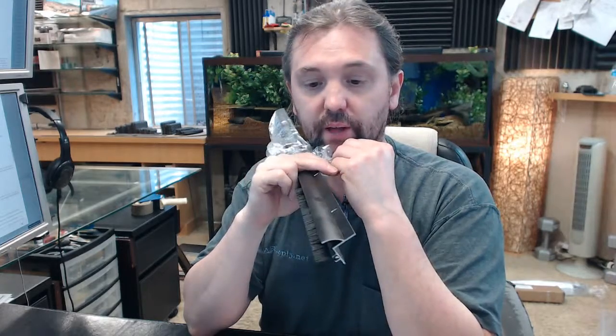There are always unusual applications for hardware. If you've got a 2-1/4 inch thick door or some very odd thickness, and you want a drip cap on the outside, some people will take this and install it on the outside face of the door, then get the L version with bristle but without the drip cap and put that on the inside. It gives them two points of seal, plus allows them to shoe the bottom of the door — even though it's not a U-shape, it gives pretty much the same end result.